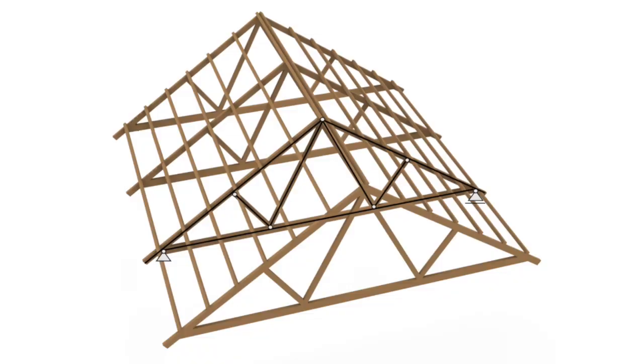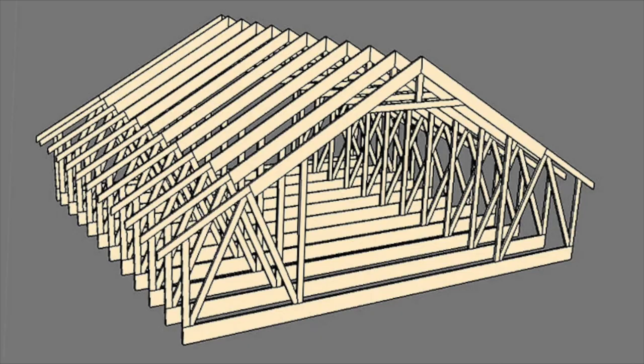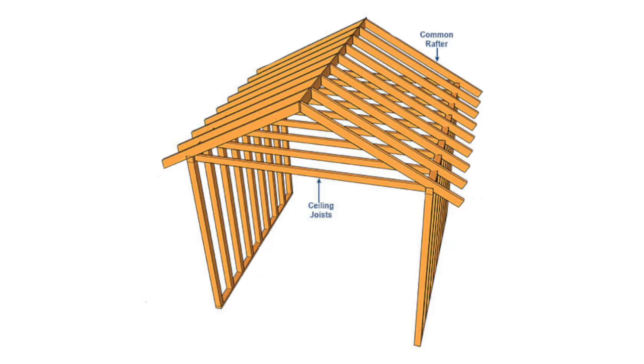The two most common types of roof systems are truss and rafter. A truss roof is a web of two-by-fours, making it stronger than a rafter roof in some ways, but it does not leave a lot of room to create storage or living space. The exception would be an attic truss, specifically made to create attic space. I have a rafter roof, which has a lot of space and is more conducive to storage. The focus of this video will be on rafter roofs.